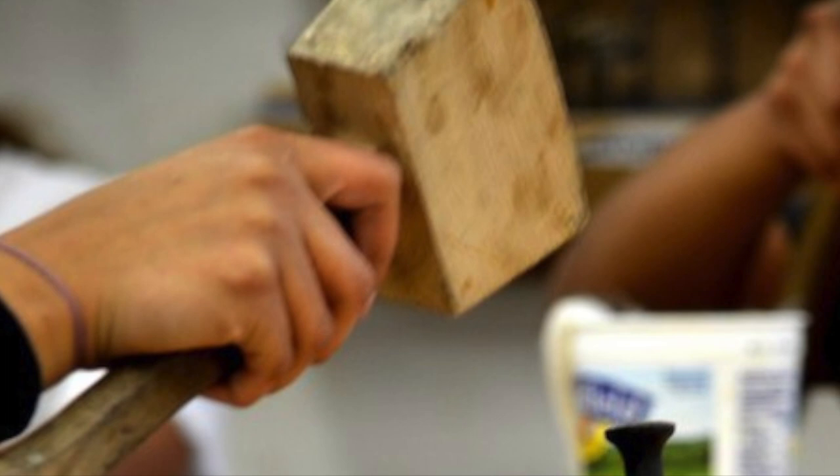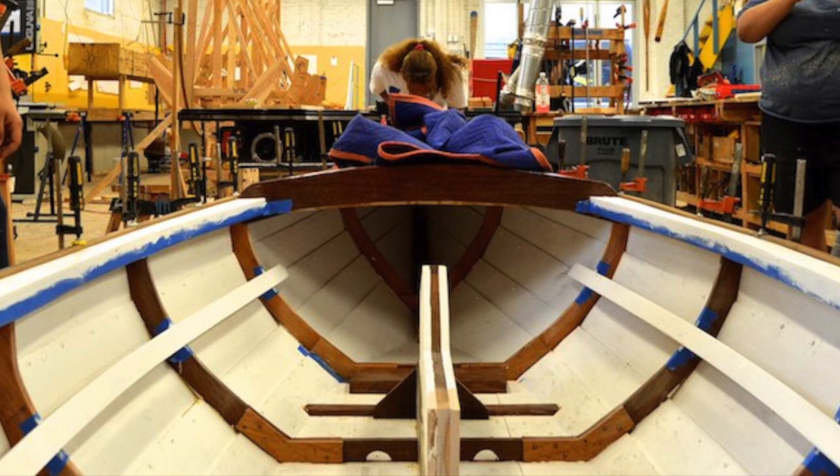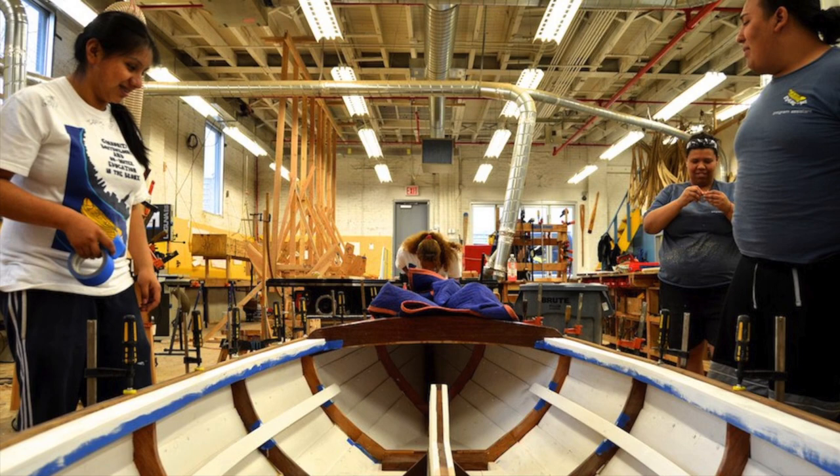It's exactly the same way with a chisel. If you're using a chisel a lot of times, you're doing something that there's not really an equivalent machine way to do it. When you cut a stem rabbet, it is a constantly changing bevel. It'd be such a complicated machine — just the jig that you'd have to make to do the rotating is fairly complex.